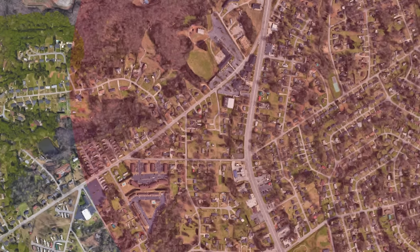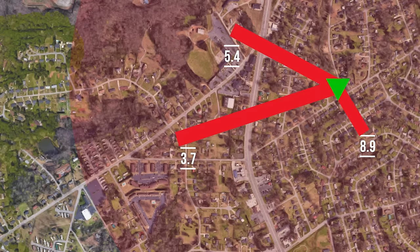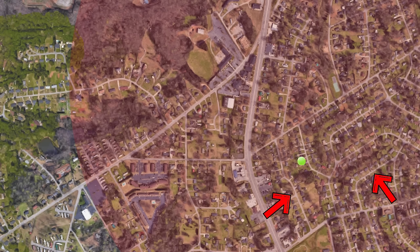And to do this, the user takes measurements of a signal at various positions and then triangulates the position of the transmission or just follows the increased power level, and they can do this even if that transmission is completely encrypted. So as annoying as it is to admit, those Instagram live warriors are right. It's very easy to fox hunt a repeater if you want to jam transmissions or just find its location. Or, as maybe far more likely, use that location for a concentrated military strike, making it extremely challenging for a civilian force to have any sort of functional radio solution.